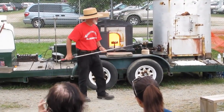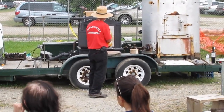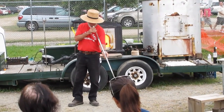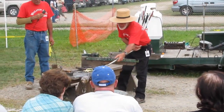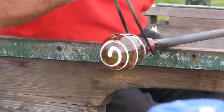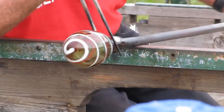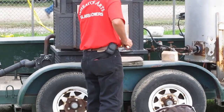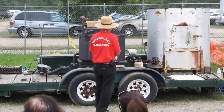When he swung that, he was using centrifugal force to get the piece a little bit longer. When you do this, you have to be very careful, because once the glass starts to move it can go all of a sudden — you can go from a six-inch piece to a two-foot piece in a heartbeat if you're not careful. He's redefining that cut down, because this is where the piece has to come off. At some point he'll score the sides, flatten the bottom, and he doesn't want that to move.